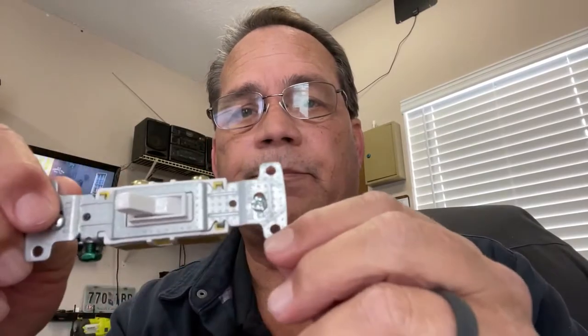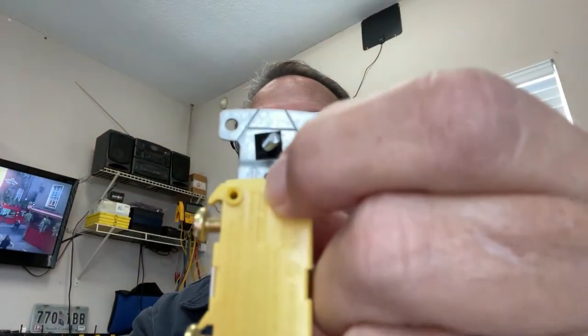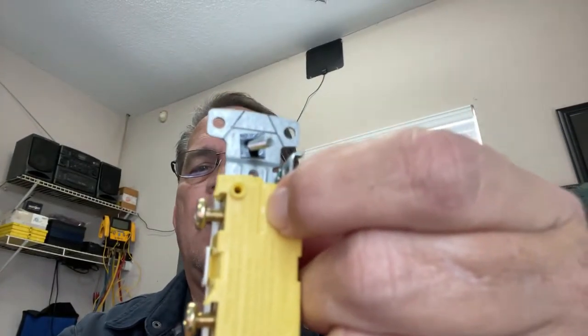So anyway, that's how you properly wire an outlet. It's going to be the same thing with the switch — on the back of this switch, this is my wire gauge right there. So I'm going to put my wire on there, mark where I'm going to strip it back, get my crimpers, and pull off the perfect amount of insulation.